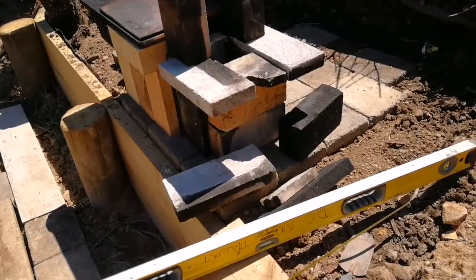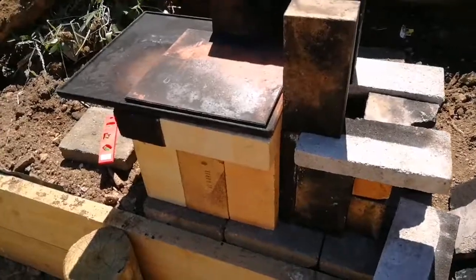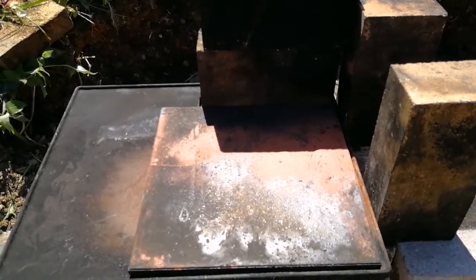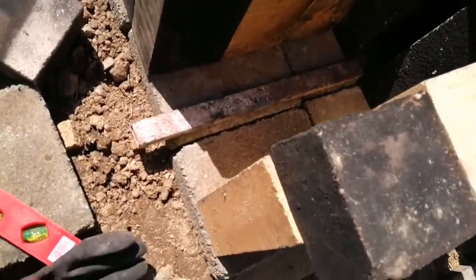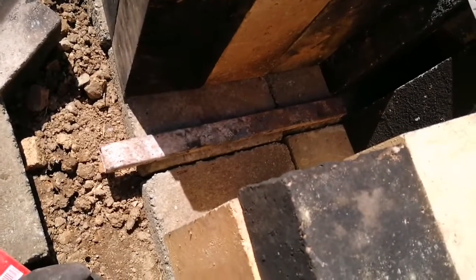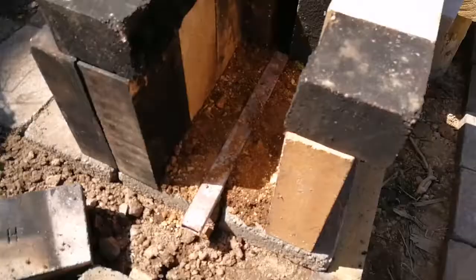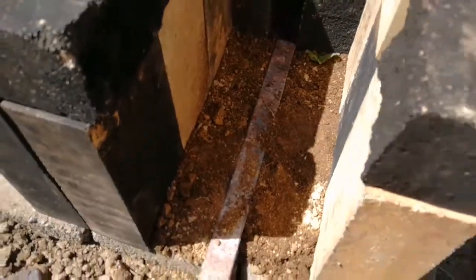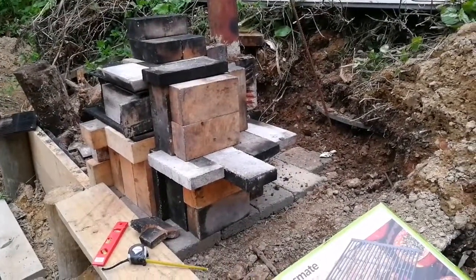It's looking like a bit of a jigsaw puzzle at the moment. Because of the different size fire bricks, I'm having to try and stack everything, make gaps and fill them — there's a big gap there so I'll stuff some dirt or clay into those. I've got to put my secondary air channel in and then protect the floor of the oven with some dirt, because there are only concrete pavers rather than fire bricks. A little bit of dirt tapped down and I'll carry on.